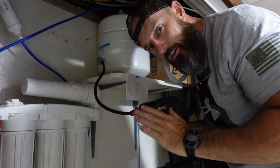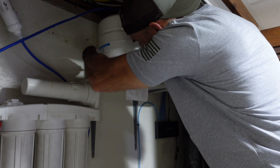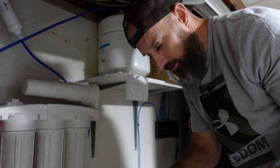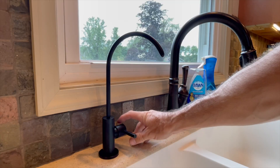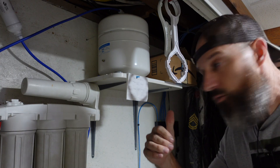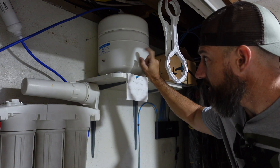If yours is not really that low, you may not get much water at all after you try to purge the rest out. Now I'm gonna let that water finish draining, then we'll check to see if I have the five to seven pounds in this tank. It says I have like 12 pounds of pressure in there right now, which is a little higher than the manual says, so I definitely purged all that water out. I'm gonna shut this valve.